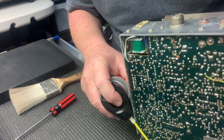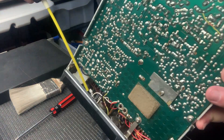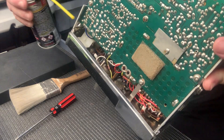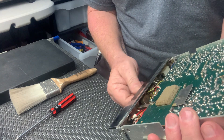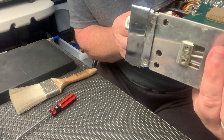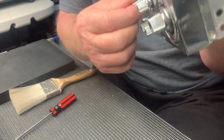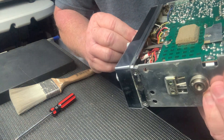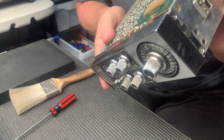I think that's done it. I'll get one in here as well — it's a bit tricky, but you can get inside the different pots and give them a quick spray. You don't have to soak it, you don't have to drown them or anything like that, then just give them a quick work over. I can feel that one already — the volume. That was the one that was giving me the most drama. Oh, that's freed up straight away — that is bloody fantastic! That was the one causing me the most grief, obviously the volume, as everyone would know.